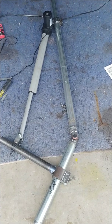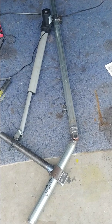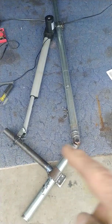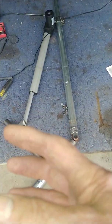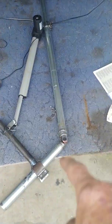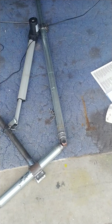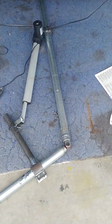I did it before with gravity and it was much too sudden, much too rapid. It just keeps moving. What will happen is this will become 90 degrees so that the hex beam will be facing sideways. But when I lower the antenna off the mast, the hex beam will continue to be facing upwards. That means I can put this pole almost on the ground and have the hex beam facing up so I can do service on it.